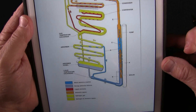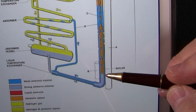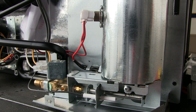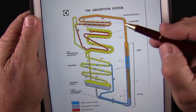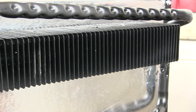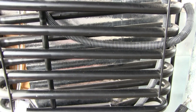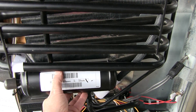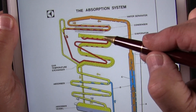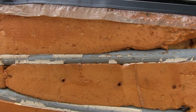The cooling unit is comprised of four major sections. The boiler or generator is actually buried inside a metal enclosure filled with insulation on a completed refrigerator. The next major component is the condenser, here on the diagram and on an installed cooling unit. Another is the absorber, the coils positioned here on the chart and on the cooling unit. This tank-like component is the absorber vessel or leveling chamber. The evaporator, right here on the diagram, is not readily visible on an installed refrigerator since it's buried inside a block of insulating foam.